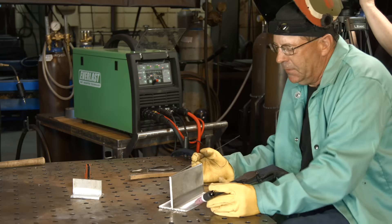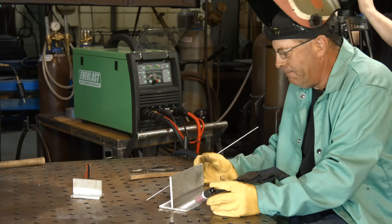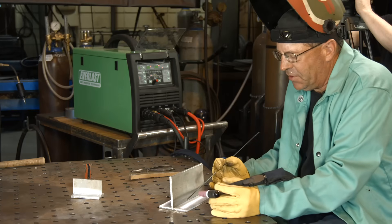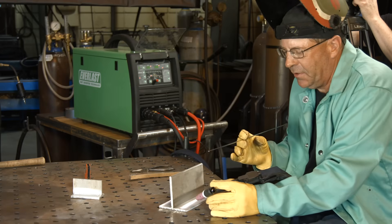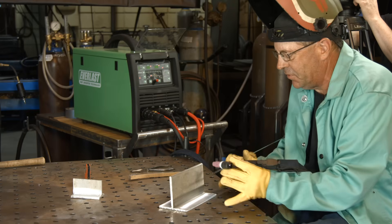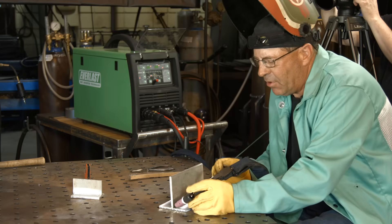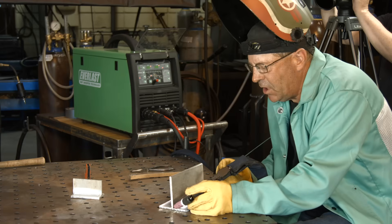Welcome back. I'm going to do this quarter-inch aluminum — running helium, and I'm running an eighth-inch filler wire because I want to get a decent profile. The timing of this, you're not going to be able to see the pool really clear. Those of you that have welded with pure argon know that you can see everything, but this has got kind of a soot around it and a strange looking arc. Hopefully the camera guy over here will catch this. Get him woke up and get him in focus. Ready?